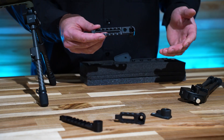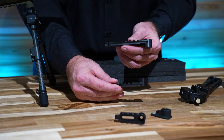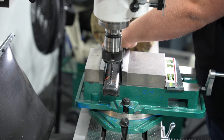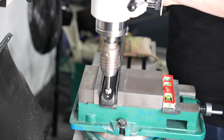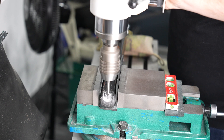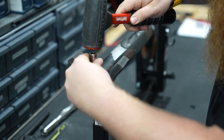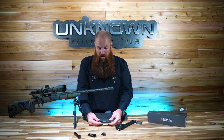The partner to the universal rail is the flush top. You can see a big difference right away: on the flush top, the boss protrudes down into the stock, giving you a nice clean flush look once installed. It will require some work — you need to drill the rifle out about 0.375 inches for the boss to fit into the stock, using a three-quarter inch drill bit or spade bit. I would recommend using a drill press or mill rather than drilling by hand, so you can level the stock in both axes and make sure that boss goes in perfectly straight.